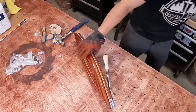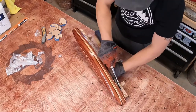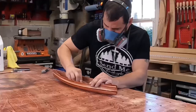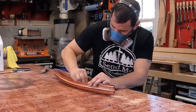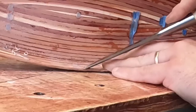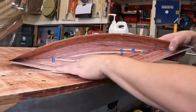With just the stem molds in place, I use a chisel to break those loose so I can pull it off the form completely. Then I need to sand down the inside of all the planks and get rid of any excess glue or tape from those stem station molds. This will take a little while.